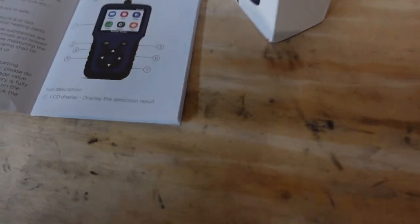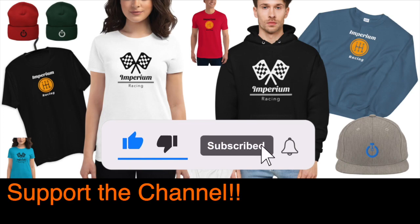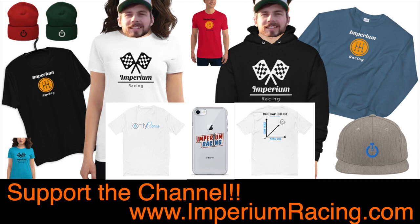Now I'm going to try the start test and charging test to see how those run on this tool. Then I'm going to go test the silver Subaru battery and try to do a start test on it, because this tool says it can do that. And if it does start, we'll do a charging test. I always just look at battery voltage with the car running to tell if the alternator is working, but this says it'll do a test — so let's give it a shot and test the tool out.